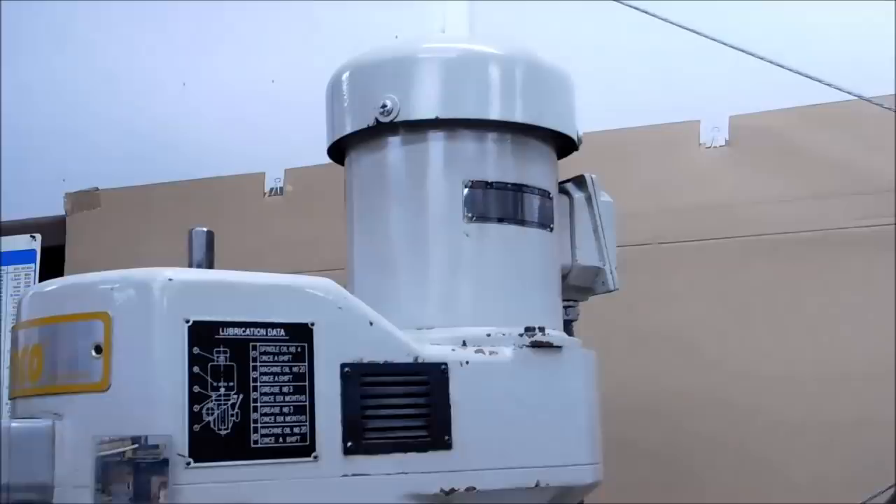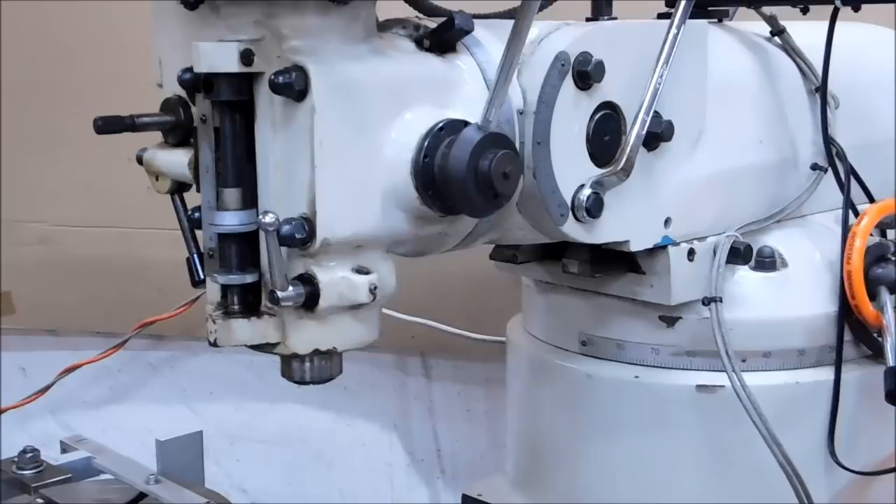This is a three-phase motor on here, and the three-phase motor will allow you to go instantly from forward to reverse. So make sure whatever you're doing, you know exactly what you have. This is a variable speed machine — this dial right here, as you crank it clockwise or counterclockwise, the speed of the machine changes. If you're in high range you look here for your basic reference speed, and if you're in low range, right here.